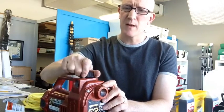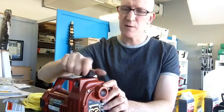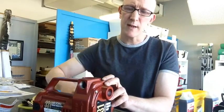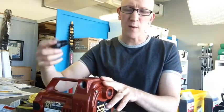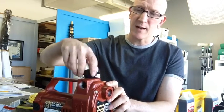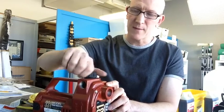Over here we have the priming chamber. Every time before you use the pump, you would unscrew that and pour in about two cups of water. You need to start off with about two cups of water inside — you don't want to start dry or else you're going to damage the pump. You're basically just priming the pump. When you're tightening this back up, it's just a hand tighten; you don't need a wrench or anything like that. Then you're pretty much good to go.